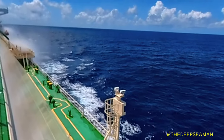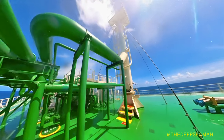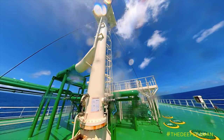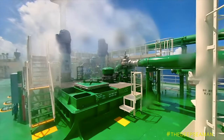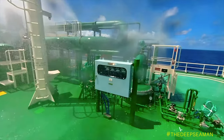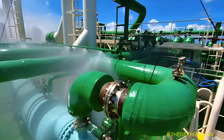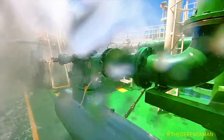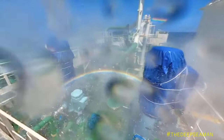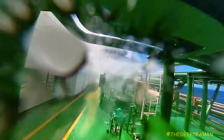As I walk past the locations, please identify the nozzles — if you can't, tag the timeline and comment below. We are testing the system at open sea, but in case of a fire it can be used at port as well. After using sea water in the system, we need to drain it and flush with fresh water — I repeat, flush with fresh water — to remove all salt deposits that could clog the nozzles. If this is not done, the next test will likely result in blocked nozzles. Be careful though: the spray pump is a very large capacity pump and within about 10 minutes could drain 30 to 40 tons of fresh water. A better idea is to flush section by section using the isolating valves.